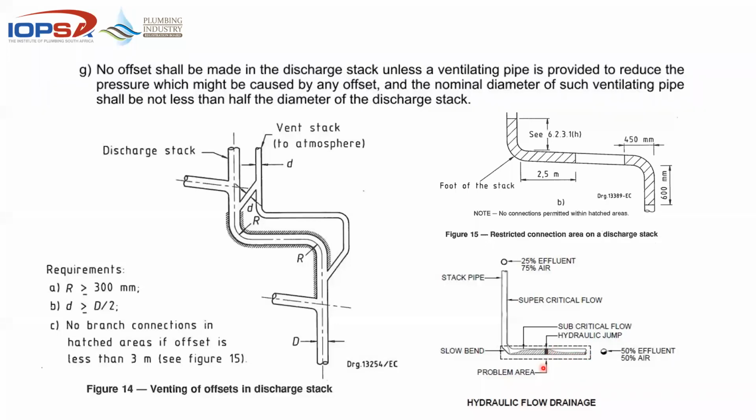You see, after that sealing off and the water moving in that column, as it slows down, the water starts settling down again, and we have air above the water, and it starts flowing like a normal drainage installation. So although this sounds like a lot of waffle, you'll see that there's a very good practical reason when it comes to saving or sealing water traps.